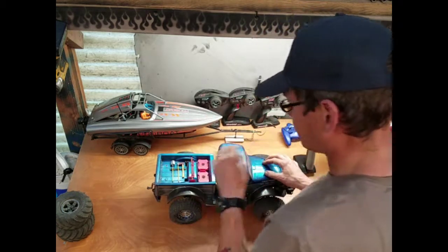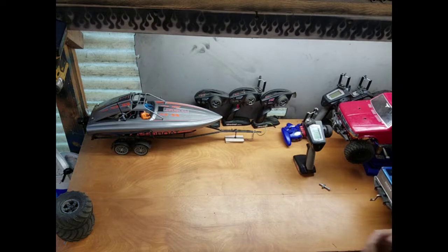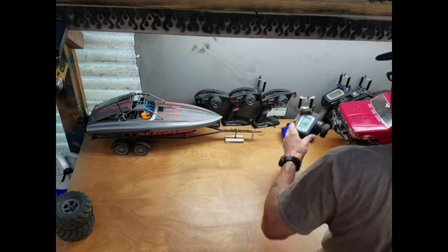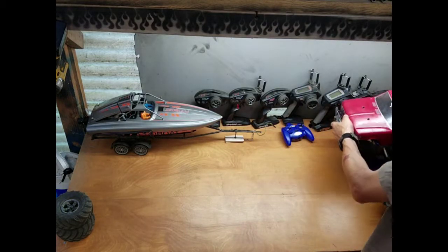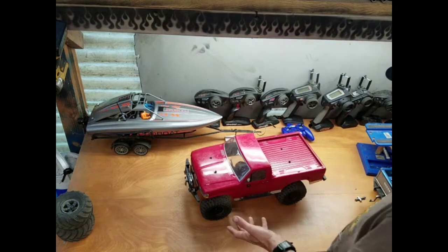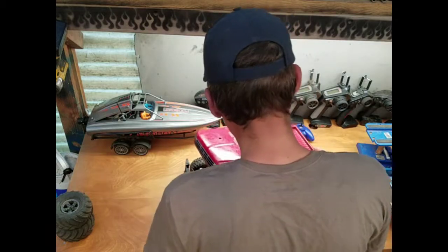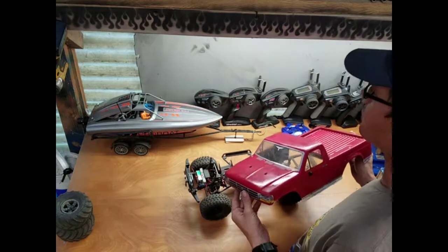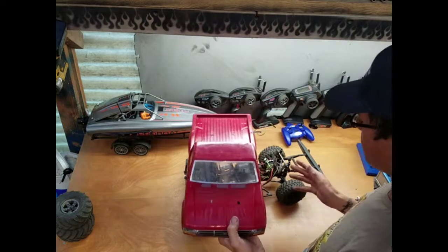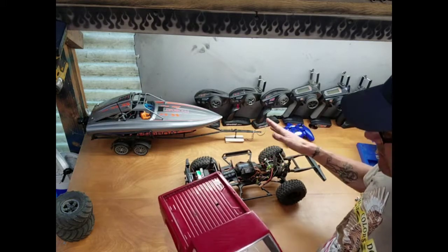The only mechanical failures I've had, other than a glitchy Mamba X, is actually the second Mamba X I've had problems with. The first one failed to recognize the sensor harness — I was having issues with it cogging and not wanting to run. The second Mamba X is failing to recognize the aux wire, so when I shift from high to low range it doesn't switch from rock racer to crawler mode. I've tried re-downloading the software, tried earlier versions, tried different harnesses — can't get it to work.